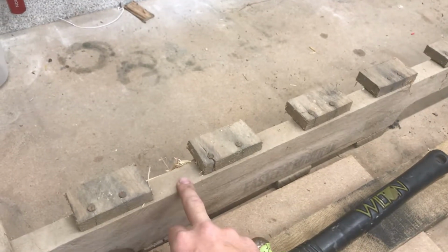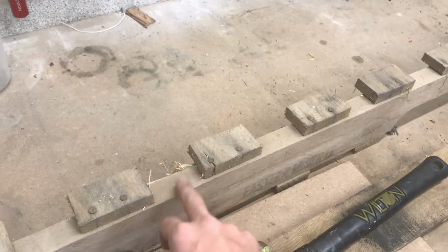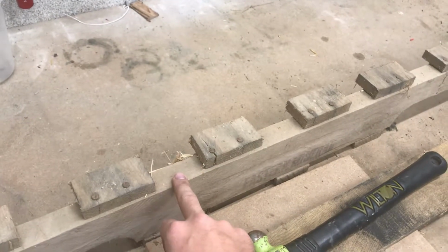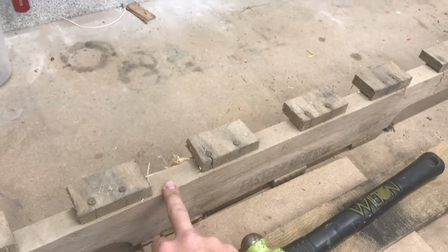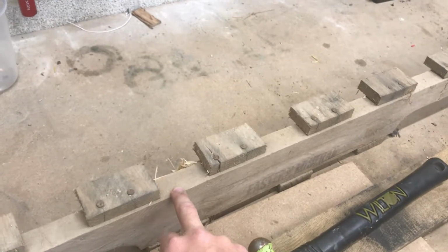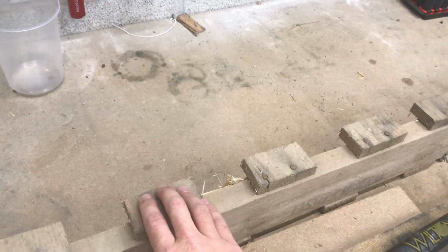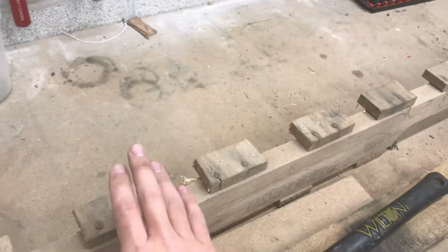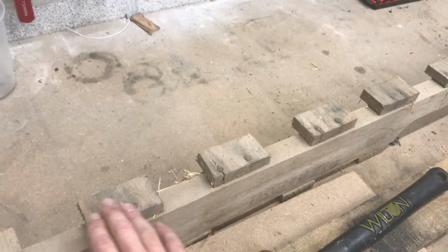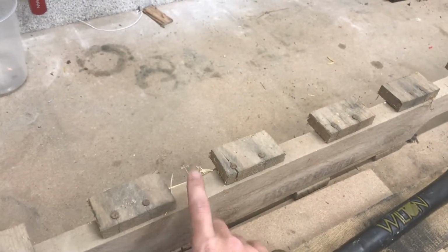If it's a really heavy duty pallet, sometimes these spiral cut and often glued nails can be extremely difficult to remove out of these stringers. So we'll spend some time talking about that. If you don't need to maximize all the wood that you save out of the pallet, you're just worried about the top part, maybe for decoration or overlaying or something like that, definitely the fastest way to break down a pallet is just to cut the top parts off and then not worry about taking any nails out.